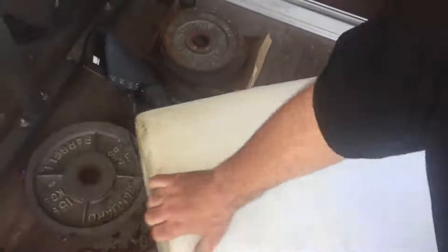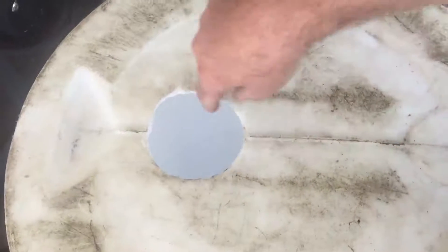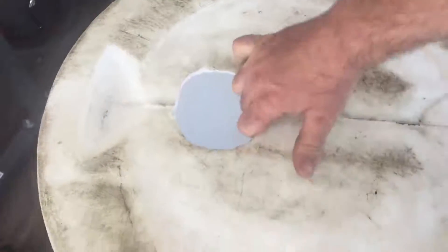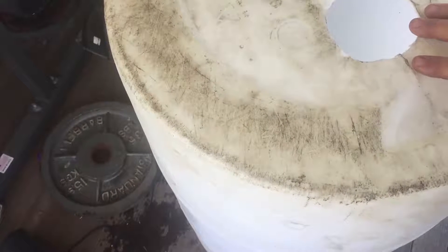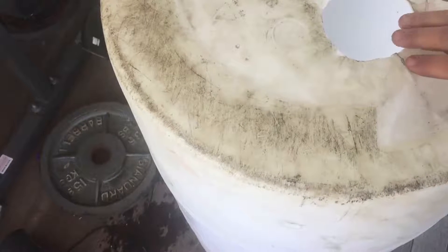Basically, the top of the barrel normally will become the bottom of your barrel. We're going to put the spigot here, then turn the barrel over and pop a four-inch hole right in here, as well as make a hole in the side so that you can put your overflow — that's towards the bottom of the barrel. Let me show you the tools and all the parts.